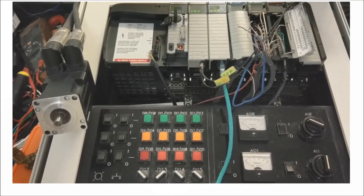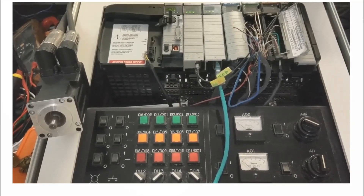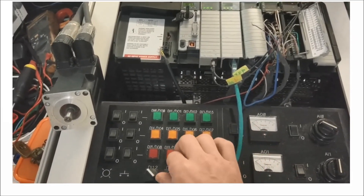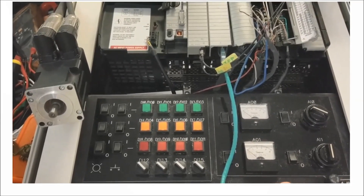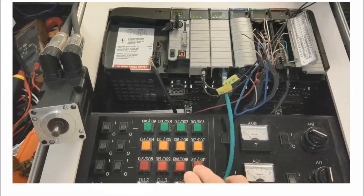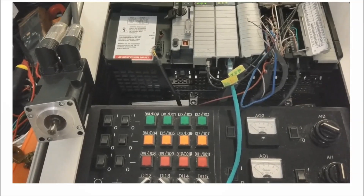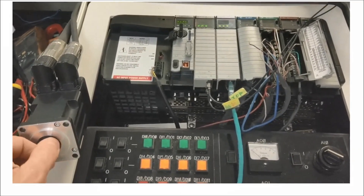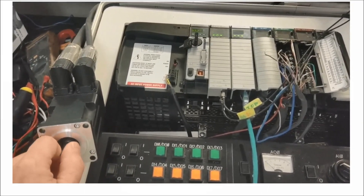If you are not familiar with a servo, it has exactly a stator, a rotor, and an encoder on the back of it. The encoder is lined up exactly with the rotor itself and it is done with an oscilloscope to know exactly when the positioning is correct. The system as a whole is a smart motor — one of the most well-known motors used for system controls where you need critical positioning. With the power off you are able to turn the motor shaft, the rotor.